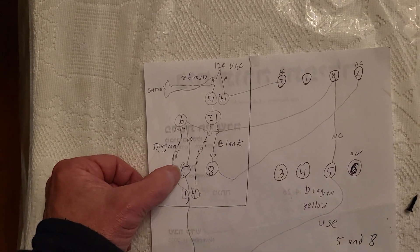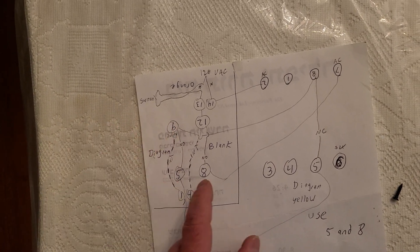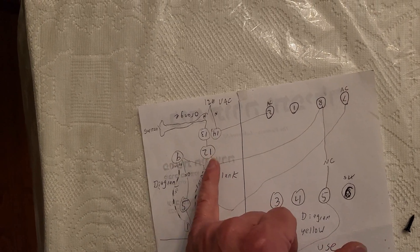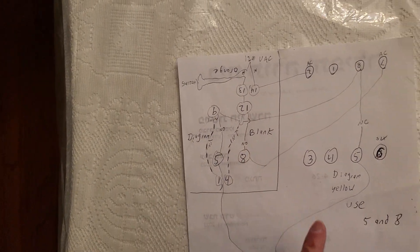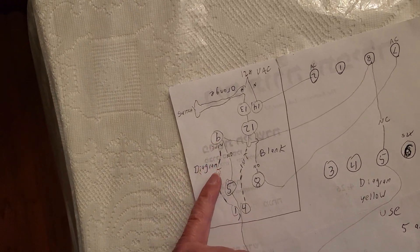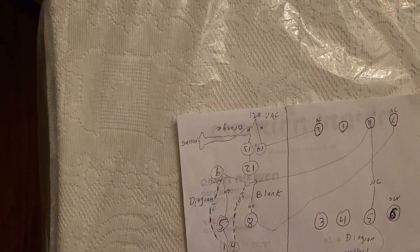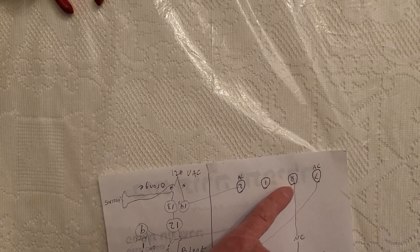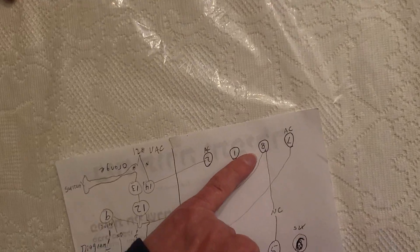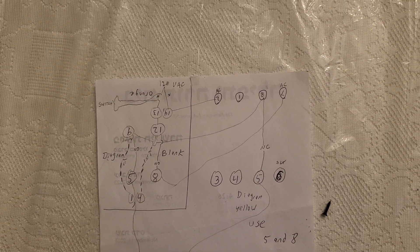Going back to the diagram, these two wires go to the actual garage control. One end is hooked up to the normally open terminals. This relay has two normally open contacts: one from terminals 8 to 12, and one from 5 to 9. The first set activates the second relay, where the second normally open contact is wired in series with the switch that opens and closes the garage. From terminal nine it runs to terminal eight on the second relay, and from terminal eight to number five, which is normally closed and set for five seconds.